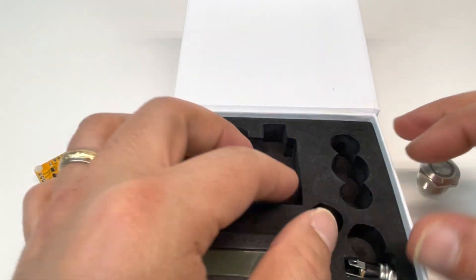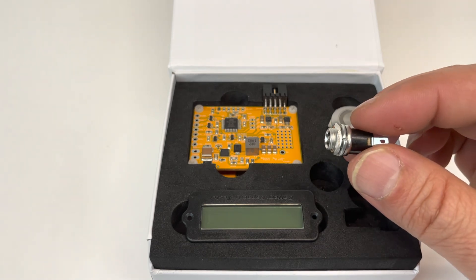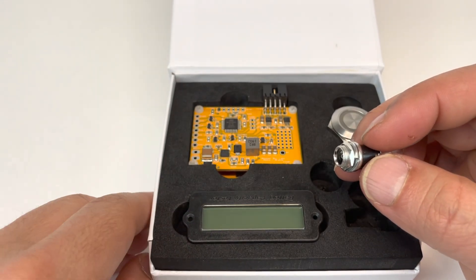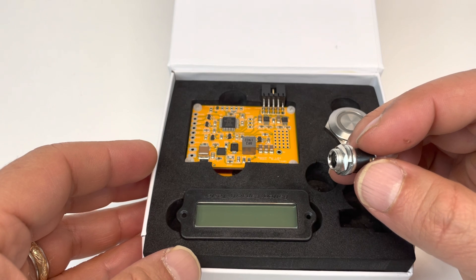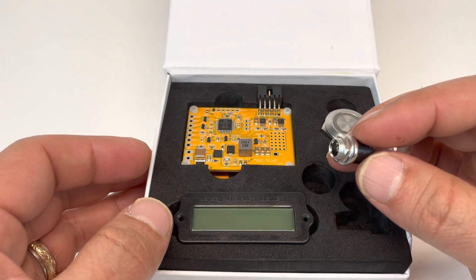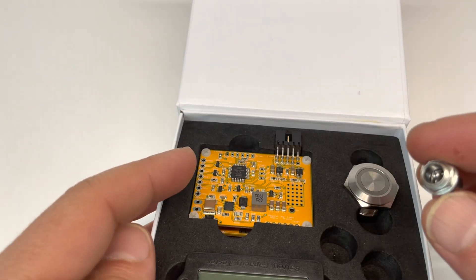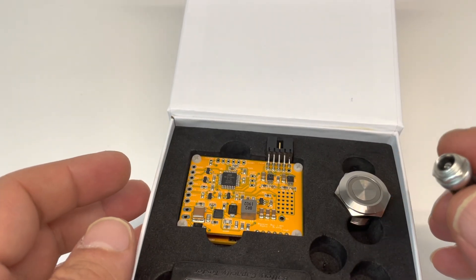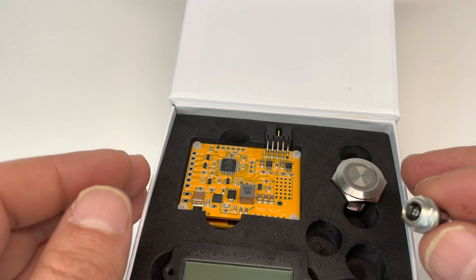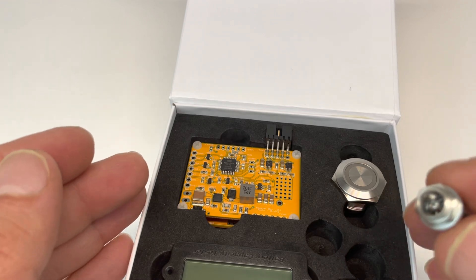One more important feature of the GLE Nano all-in-one solid-state switch is the smart charge port capabilities. When you insert your charge plug into the charge port, the LCD illuminates automatically, letting you know the state of charge of your battery and the voltage, even though the battery is in the off state. The GLE Nano is also an anti-spark solid-state switch. When the battery is off and you disconnect and reconnect your battery, you will not see a spark. This preserves your contacts and increases safety.